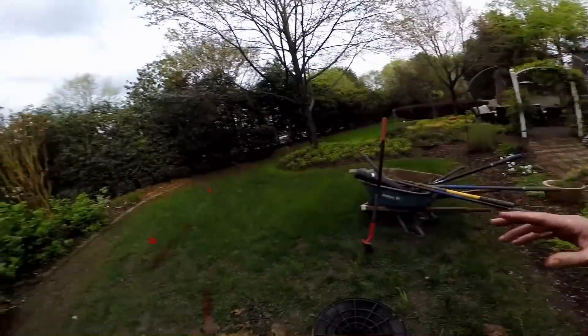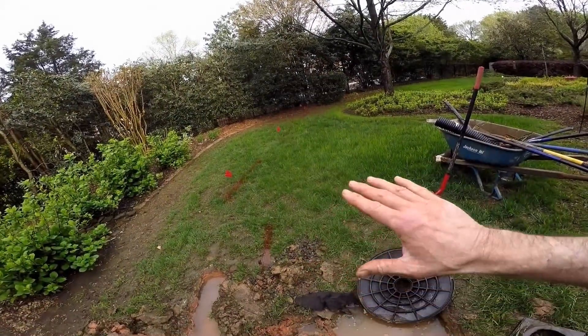You're better off if you've got a low spot in your backyard like this, and you do not have fall away from the area discharged to daylight — you're better off to put a sump pump, a backyard sump pump out here and get this water out of the yard.